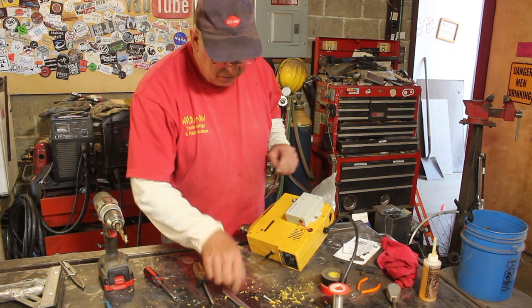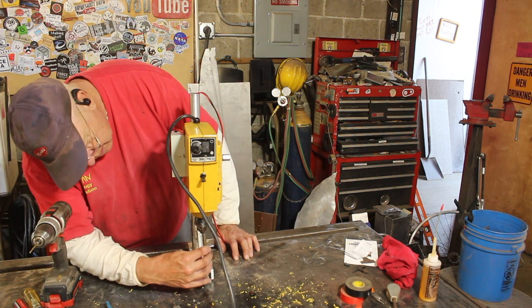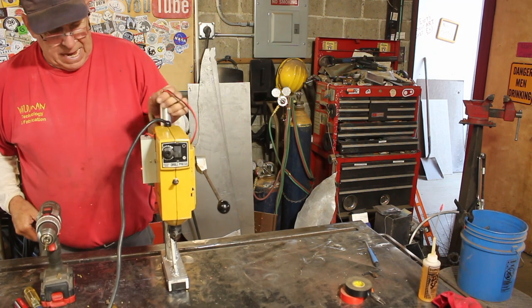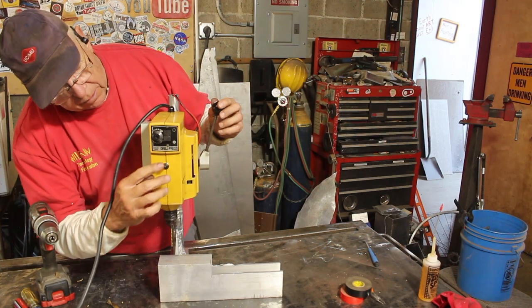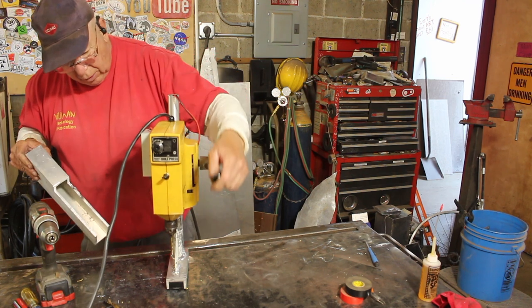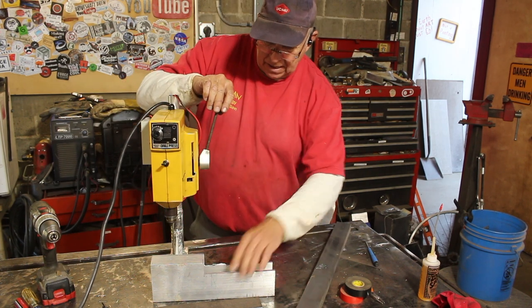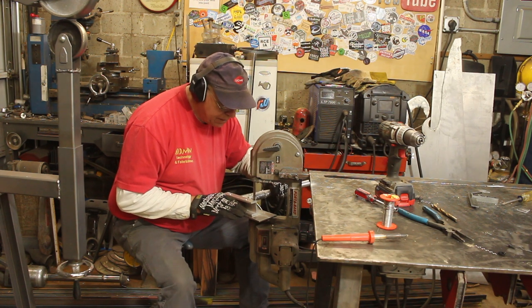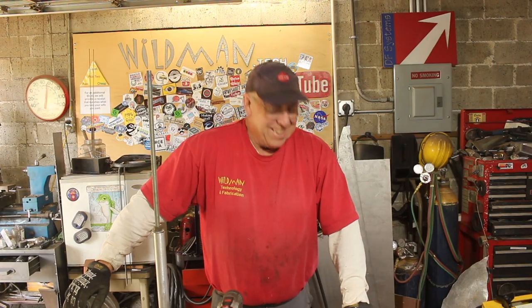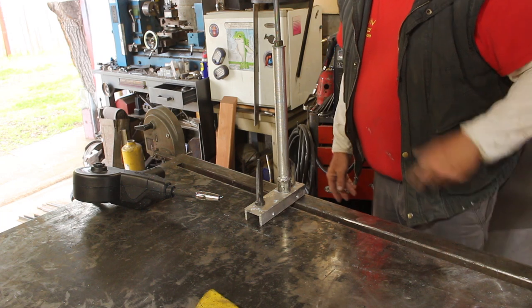This is almost together, almost done. Now that that is as low as it goes - if that's as low as it goes, it's too tall. Power supply's on and I heard a sound. Let's try to drill something. Well it held drilling aluminum. Okay, let's try a piece of steel - well that worked and it held just fine. Apparently I made the tower too tall, and because of the strong back and the gusset I can't just lower it down, so I'm gonna have to cut those off. I've cut out a section, smoothed off the top, leveled it, bolted it back in place. Now let's weld it back together.